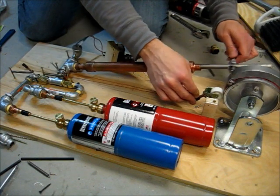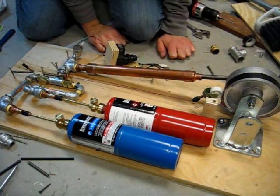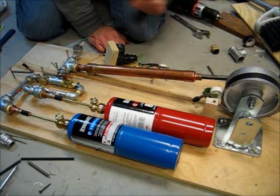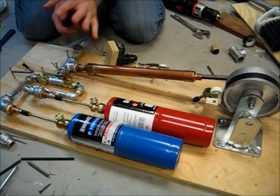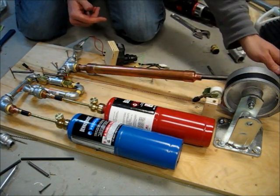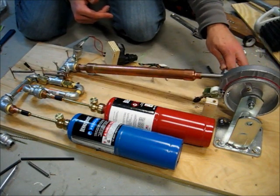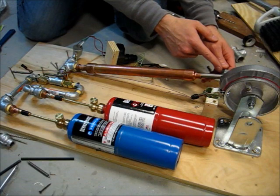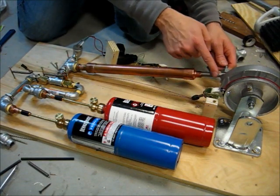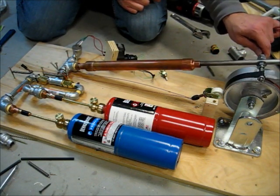Lastly, as you can see, I've added a cam system. Some people pointed out that the timing was off — it was opening at the wrong time. So this is set up now where, let's start here — there's top dead center. I would spark here, which I don't have hooked up yet. It would fire over around the top like that — that's combustion.